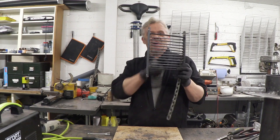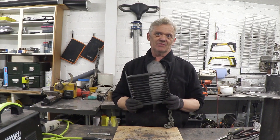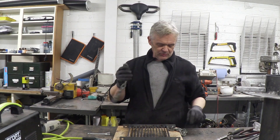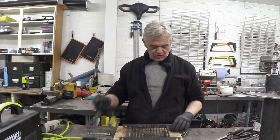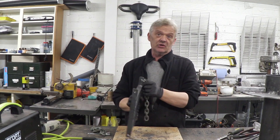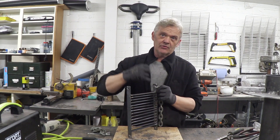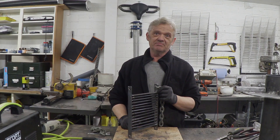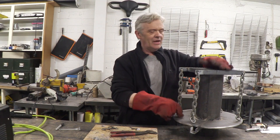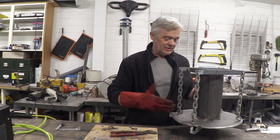Having welded my grid bars into place, obviously what I need is something to hang it on. I have a whole load of this really chunky chain that Luke donated. So what I'm doing is sawing a cut in the chain so it'll go through these holes, leaving me a bit of chain with a cut in it. I can crimp that together and put a spot weld on it, and when I've welded those chains on they dangle really quite nicely to the plate — that's where the grate is going to sit.